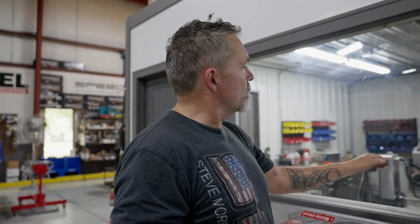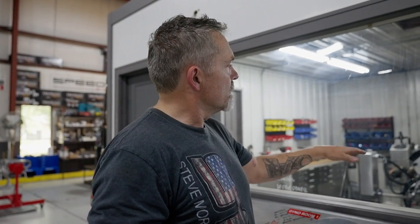because of engine clearance and crankshaft clearance, all that kind of stuff, you're gonna see that these things idle and drive down the road at about 30-ish pounds of oil pressure with 200 plus degree oil temperature when we're driving it for hours at a time. But that's normal, that's what I'd like to see. And we're measuring it going into the engine right at the filter.